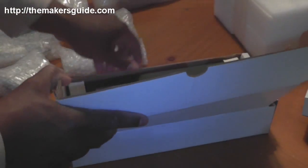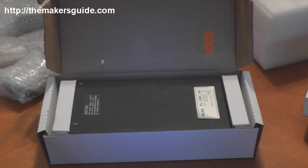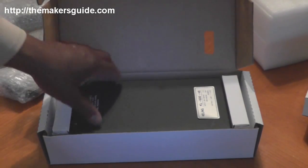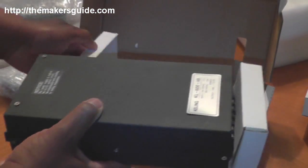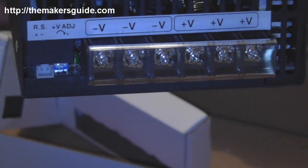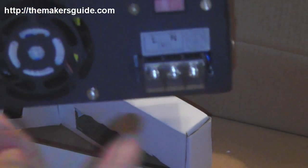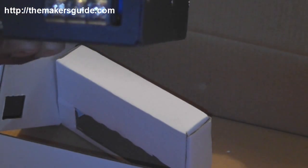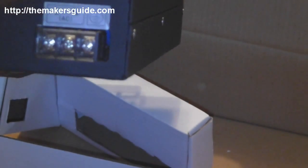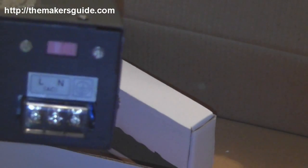In this large box we have a KL648, which is a 48 volt, 12 amp power supply. This power supply will provide the juice for all of the electronics. You can see the screw terminal connectors on the front — this part is removable so you can get in there and connect your wires. On the back side is a fan and connections for your line-in power, and you can select between 120 and 240 volts by flipping that switch. Make sure you've got it in the right position for your line voltage.